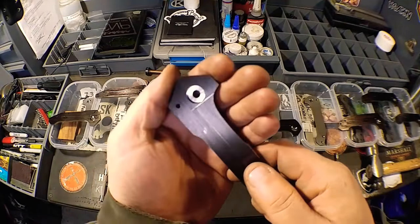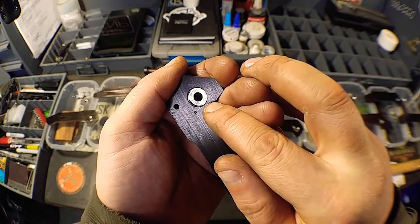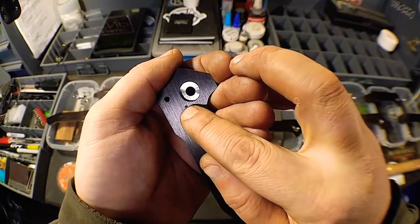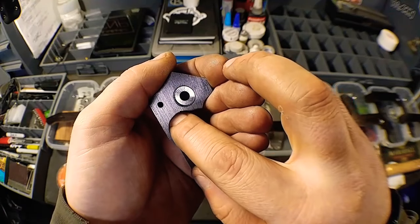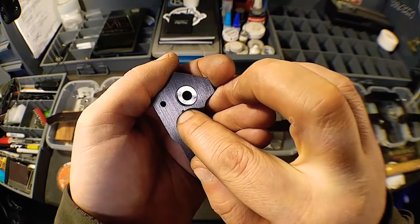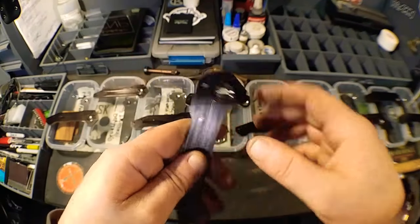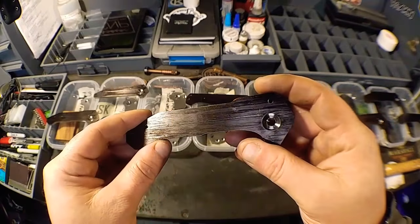And that's it. If you notice, this is a little tip, a little thing that I do. If you look at my face cut here, where it comes across, and where this mark is, it's just below, if I can get it to show, you can get the general idea. I put my center punch mark just below where I want that cut to be. And the reason for that is this is going to be an 1/8 inch hole here, and I want this cut, taking into account the thickness of my saw blade, to meet up with that hole at the top of the radius of that 1/8 inch bit. And it just gives it a nice kind of rounded effect to it. It's kind of hard to understand it the way it is now, but once I get it all drilled and start cutting them, you'll understand what I mean, why I do it like that.